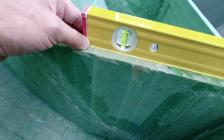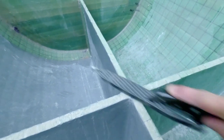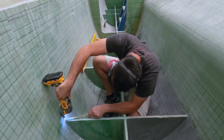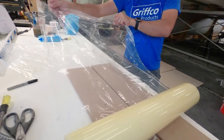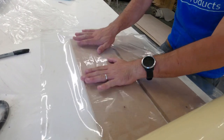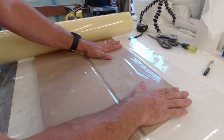Knowing that all of our webbing has now been made level, from when Matt went through a few weeks prior using a combination of a rasp saw and our oscillating tool, we wanted to make a second mold from our MDF board, which would help the 90 degree pieces of fiberglass sit flush with the top of the webbing once it was time to bond them in.